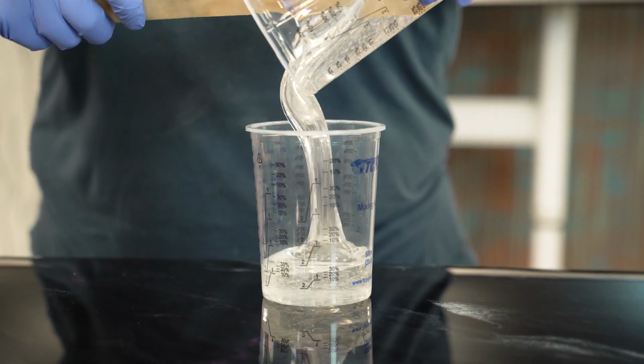And one little trick we do here at Countertop Epoxy with our resins is we switch containers at the end of our mix and mix again. So usually instead of mixing for say 7 to 10 minutes in one container, we'll mix 5 to 7 in one container, switch pails, and mix for 3 to 5 more. That second mix really ensures that there's no tacky A or B that's unmixed sticking to the sides of the container that will contaminate your actual surface and not cure.